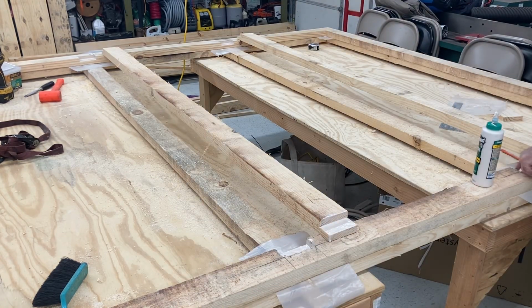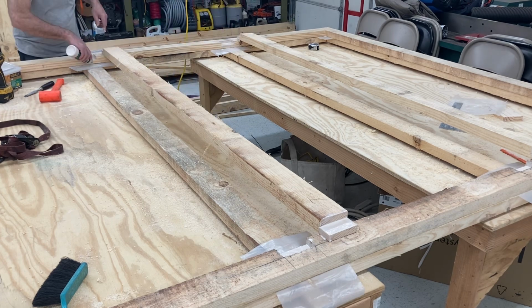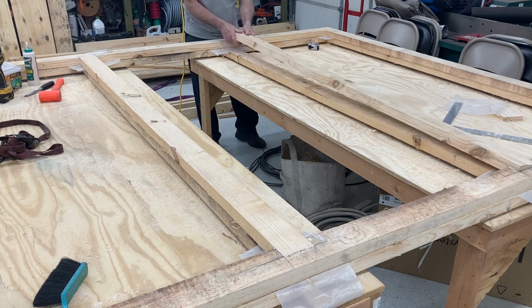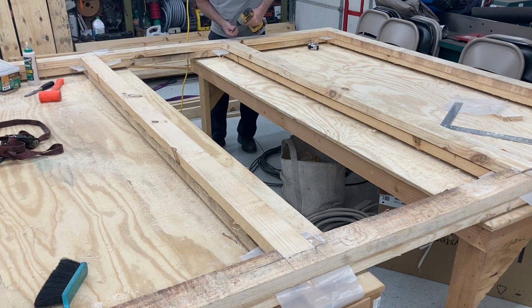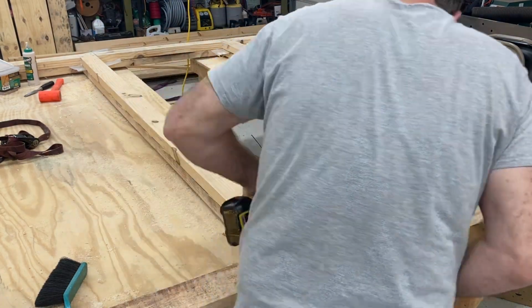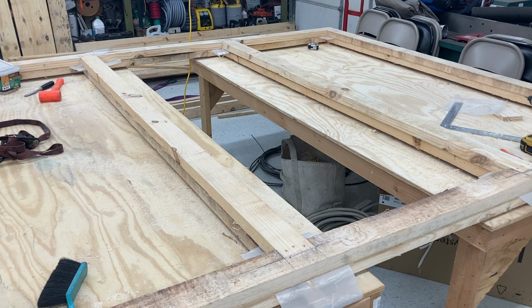I'm attaching to the top of these doors with a metal angle bracket that I fashioned myself out of some flat strap. Forgot to get any video of that. They just have several screw holes to interface with that top 2x6. They're actually a U shape that goes down both sides of that 2x6, and then through bolts. I put 1/4 inch through bolts through that 2x6, and then they've got a slot in the top of them to accept a bolt that hangs out of the bottom of the little wheeled truck that rides in the unistrut that I'm using as the track to hang these doors on.